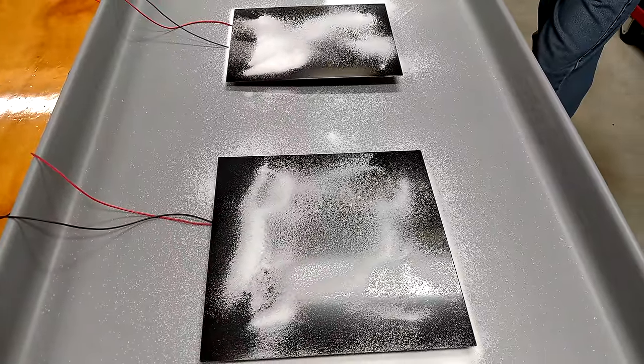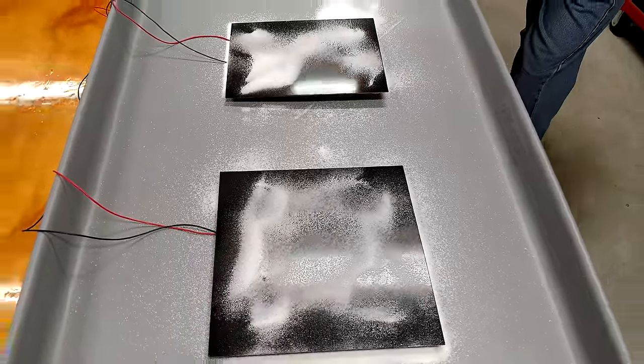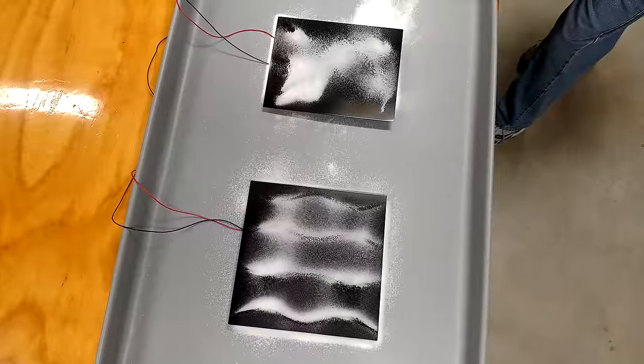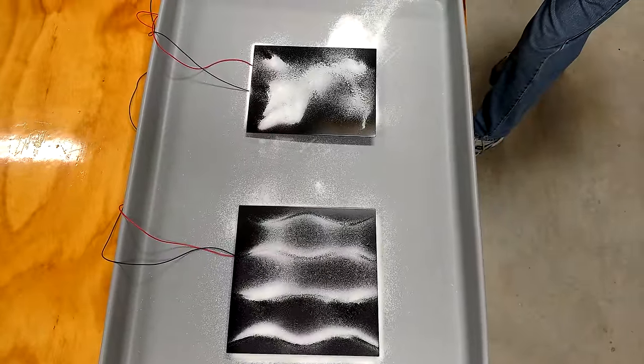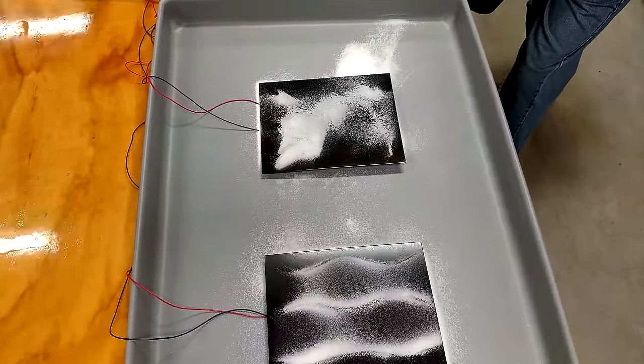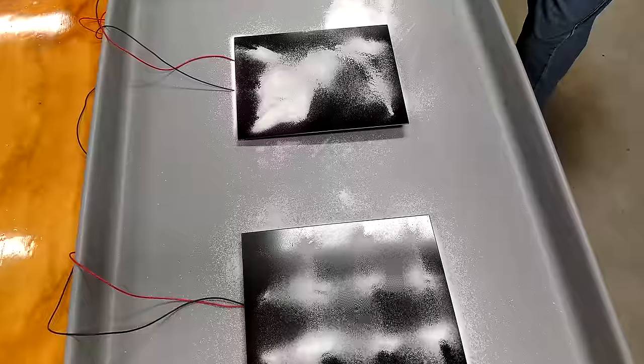This continual vibration of the sugar on the modified plate means we're getting a much flatter sound response. We want the peaks to come from the music, but we don't want these huge peaks that occur when a particular plate is in a resonance mode. The other plate is not doing that — and while not visually appealing, acoustically it's a far better way to do this.